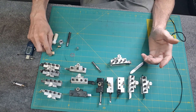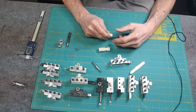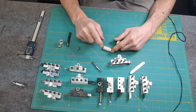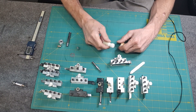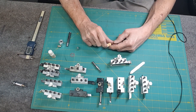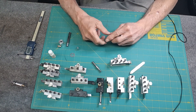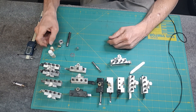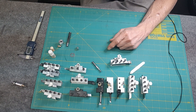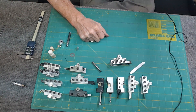On materials: if you want to use plastic, any tool will work and it comes out gorgeous no matter what you do — facing, this, that. Generally I use my aluminum inserts on plastic. Wood is the same — doesn't matter what you use. I've been making my own little drawer knobs. For steel, I already said which tool I use. That's kind of years' worth of experience summed up.